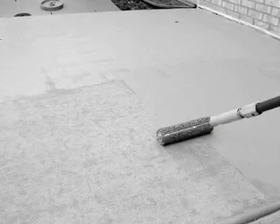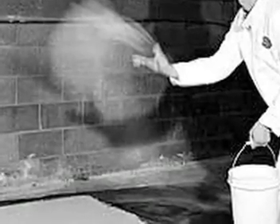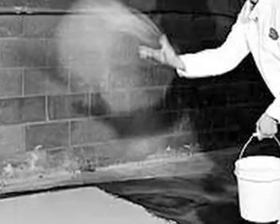The next day, he applies an epoxy coating from Crown Polymers, and while it's still wet, he broadcasts sand onto the surface until it no longer wets from the epoxy. As a result, while the epoxy is attached to the vapor block, the sand acts as a tooth, and now the overlay can be attached to it.